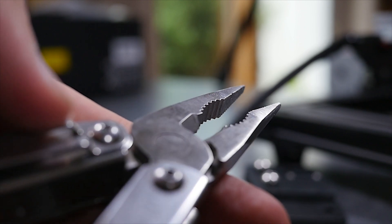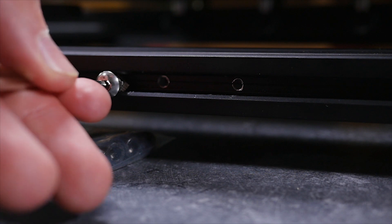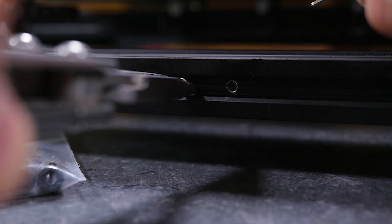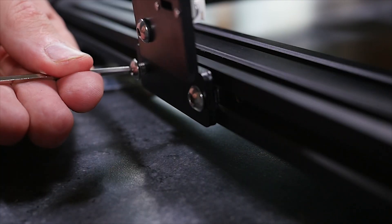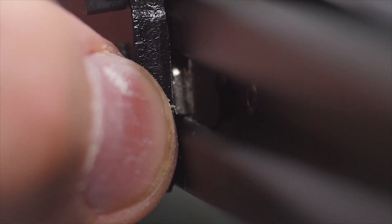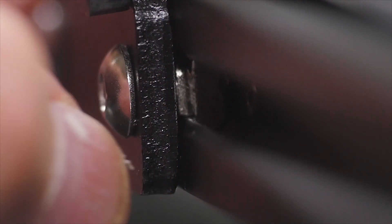To do it manually, you're going to need pliers. What you're trying to achieve here is to get the T nut at a 45 degree angle to then be able to do the last little twist with the pliers. Pliers aren't always needed — my second T nut was done by hand. Now space your T nuts equally to fit the new T bracket onto your newly fitted T nuts. This part is crucial — make sure that your T nuts are still vertical inside of the T bar. If they're not vertical, you're going to have to go back a step and repeat until this is done correctly.